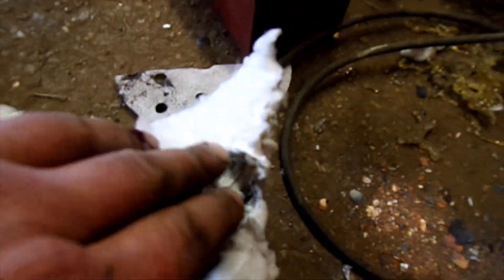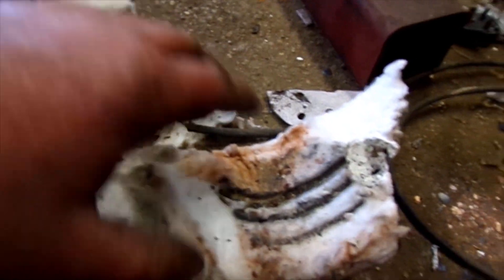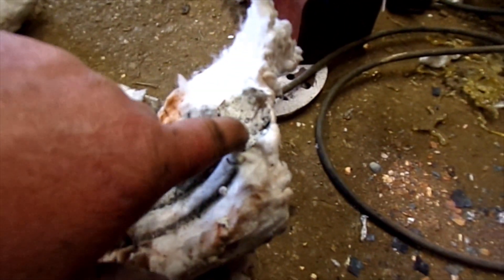The element burnt out — a bit of arcing and flashing. Oh look what it did to the ceramic. It's easy to wonder how much current — 30 amps? It hasn't blown the fuse, so it's under 13 amps at 240 volts.